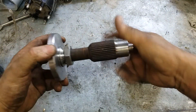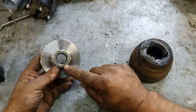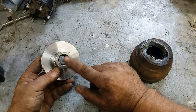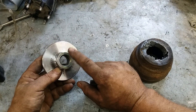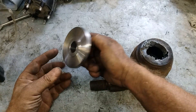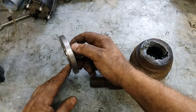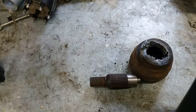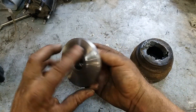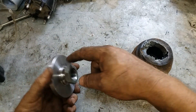Here's how I made this. This is just an axle nut — you can get these at O'Reilly's if you don't have old axles you've pulled out and saved the nuts off of. You're not supposed to reuse these nuts, but a lot of people do. I took a piece of half-inch cold rolled steel, traced around a canned chicken can to get a round circle, then torched it to get the blank, and welded the nut down to it.